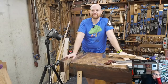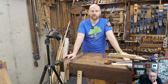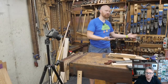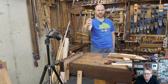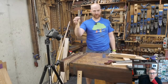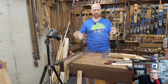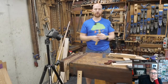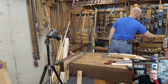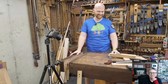Sufsanan asks: can you make a wood plane without a plane? Yes — I actually have a couple of videos doing that. The only reason you need a plane to make a plane is to make it faster. A plane is really just a jig that holds a chisel. I have a video of making a box with a set of chisels, and a video going into the woods with one half-inch chisel and a leather strop — cutting down a tree, splitting it in half, and making a bench with staked stools using just those two items. You do not need a plane to make a plane.